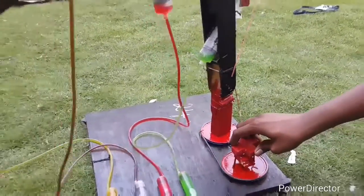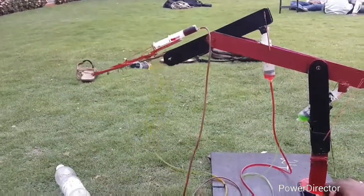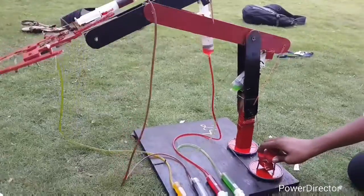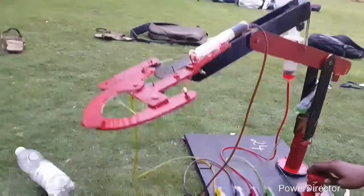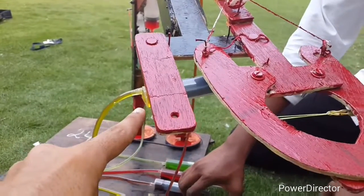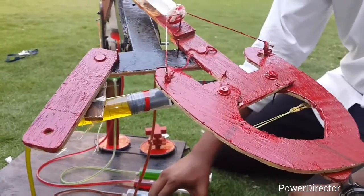The arm can rotate from 0 to 85 degrees. It is constrained to 85 degrees because the belt material used is plastic, and plastic doesn't sustain the load of the arm. So we constrained it up to 85 degrees — it can rotate up to 85 degrees like this.